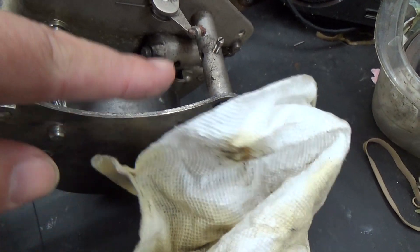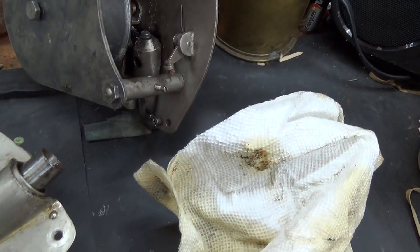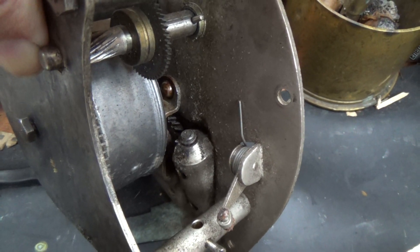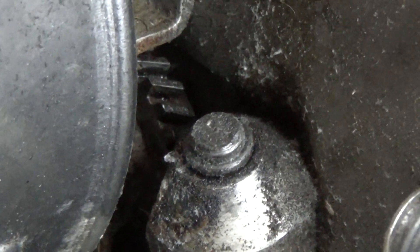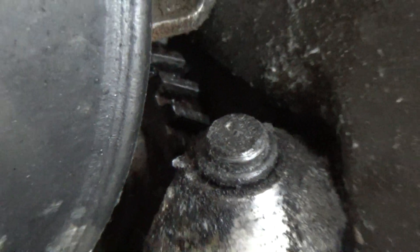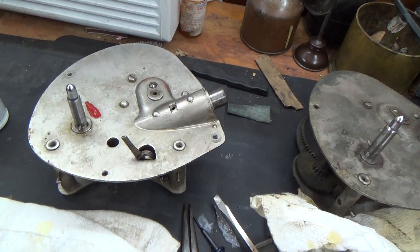Scrub it, clean the gears, clean the channel, reapply fresh grease — plenty of it, don't spare the grease — because it's probably not going to be touched again for 50 years unless you do the machine yourself. To get the clip back on: with the motor apart, push down on a hard surface keeping pressure on the end of the shaft, find a quarter-inch drive socket and extension that fits over that shaft, and give it a gentle tap. The spring will pop right back on.